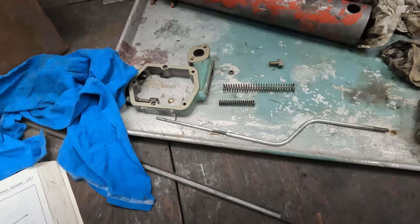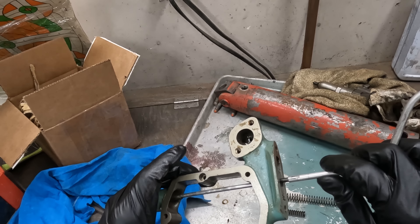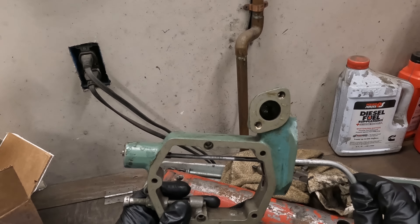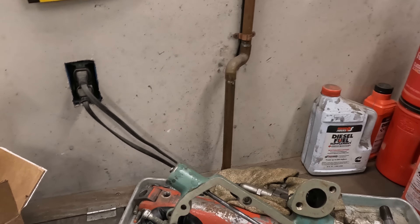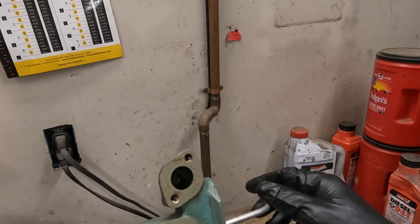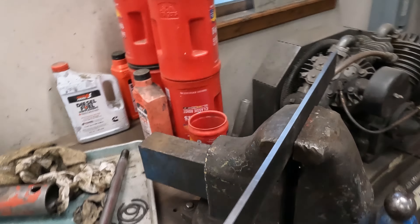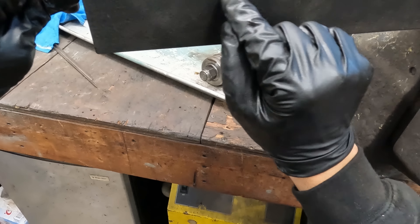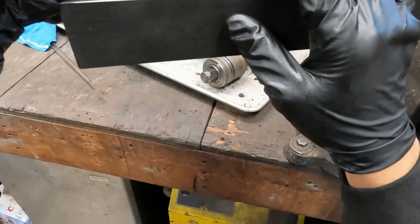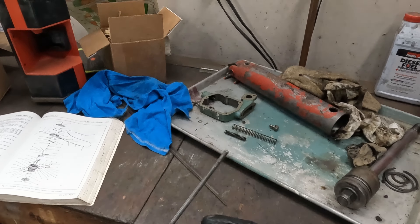Alright boys, let's see if I can get in here. There are a couple pieces of this assembly. First of all, this tube has to slide through here, but more importantly — you can see it already — I can't push it through there, it's very hard to push right now. So this is problem number one. Let me show you why. Watch this end — see that? It's bent as shit. That's problem number one. Got a straight edge here and a vice. See all the light under there, and then again over here. Now look as you rotate it — there's light here. This thing's bent in like four places. Gonna be real lucky if we can straighten it, honestly. It's bent here and it's bent there.